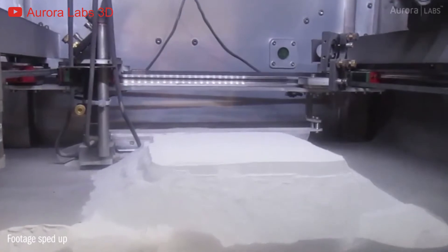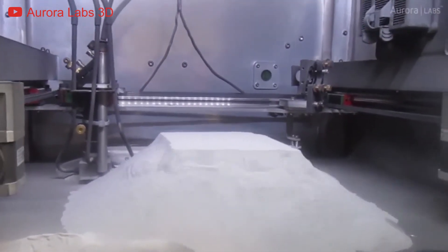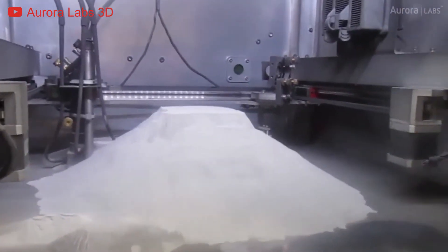After the lasers have completed the 3D print, the metal powder needs to be removed. And also it needs to be cut from the metal base plate — you can use wire EDM for that, which is a technique covered in another video. Then you also need to remove the support structure, which can be quite a lot of work. You need angle grinders and all kinds of wedges to remove it.